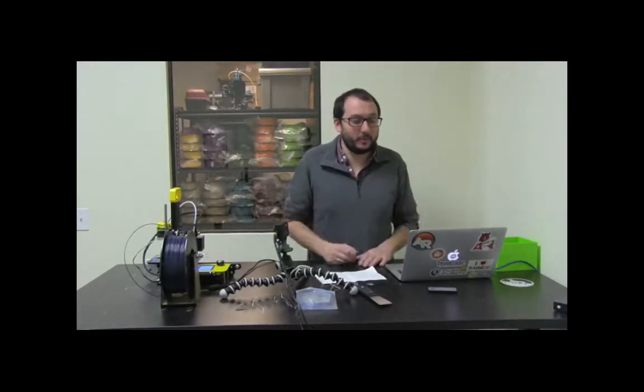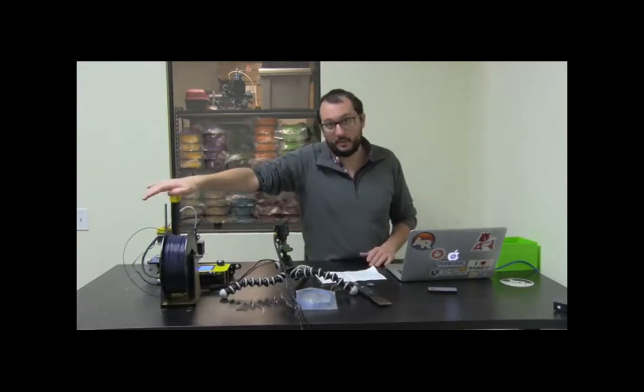And if you're going to be printing stuff that's going to be outside permanently, or something along those lines, then yeah, sometimes you do need to have that enclosed space, especially if you're going to print in ABS. ABS is an oil-based plastic, and it does help to have an enclosure on that. We have printers that print in ABS, but on these, you can't print in ABS for that reason. Technically you can. We've had some schools do it, but it warps up really bad, and that's where the warping comes from.